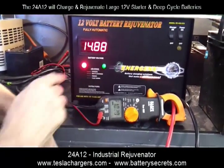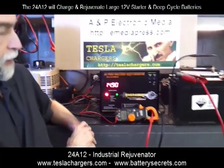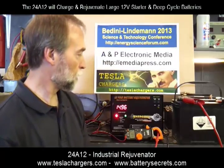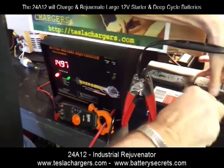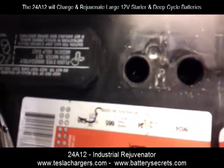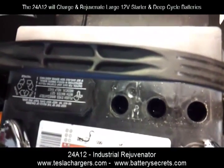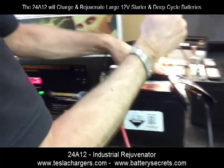You can start seeing the green light getting brighter — it's starting to flash rather fast. So, we can see that we're moving into the rolling-off process. Even though we're charging the battery pretty strongly, there's just almost no off-gassing. Even at these voltages with these high currents, there's almost no off-gassing in this battery under these conditions. This is a completely safe process to do.